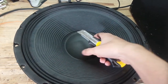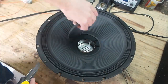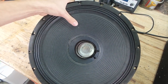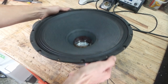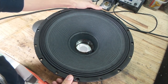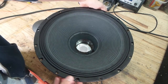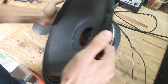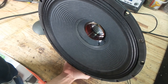So I think I'm just going to try and remove this dust cap. We'll see if we can spot anything unusual. Okay, so I managed to get the dust cap off and now we can see the voice coil. This looks like a three-inch voice coil. And guess what? The sound's gone. Now, this is interesting. If it's sitting facing up, it doesn't seem to be making any nasty sounds. But if I start lifting it up, depending on how it's oriented, it seems to be making different sounds.